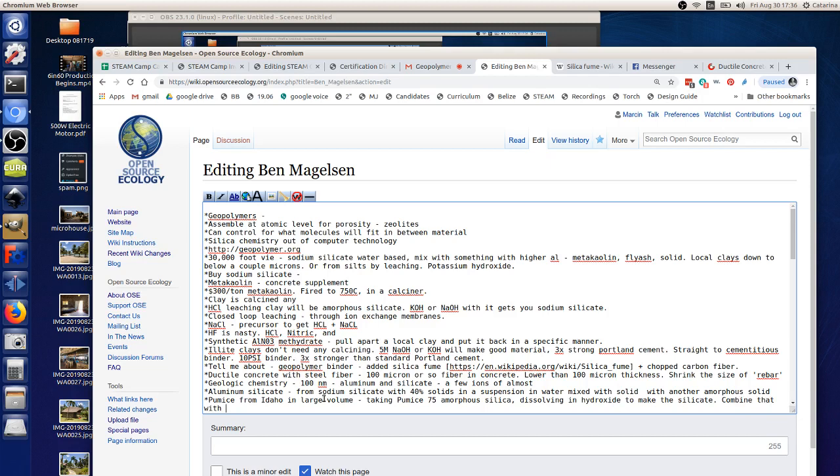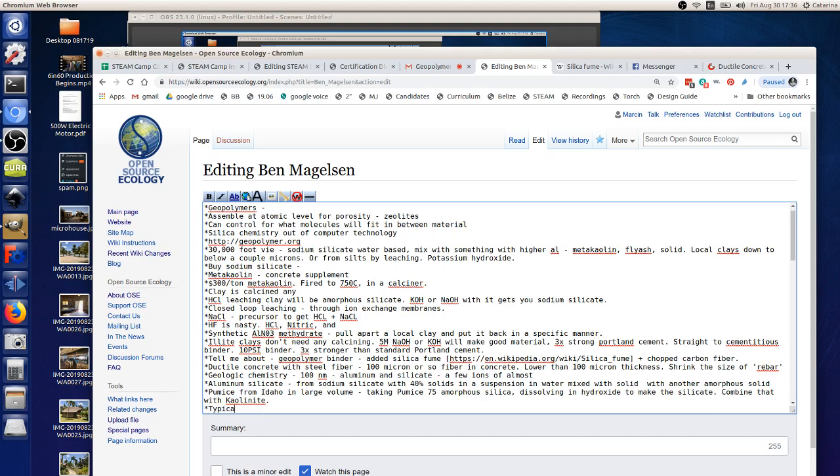Then you add aggregates and fillers, just like Portland cement. In typical Portland cement or non-super-high-performance stuff, the binder is about 25–30% of the overall mix and the rest is aggregates and fibers. In the higher-performance stuff, those ratios are about flipped — you're usually at about 60% paste/binder and 30–40% fillers.